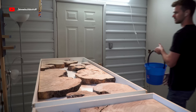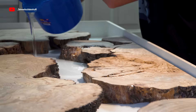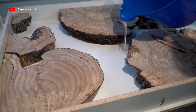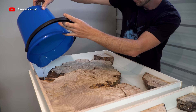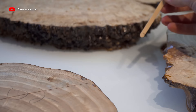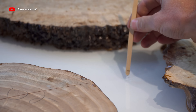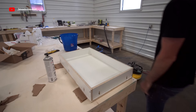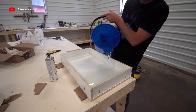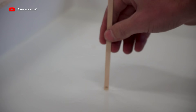This is the same epoxy I'm going to use for the whole table pour, but for now I'm just going to pour about a quarter inch on the bottom so that my lava stone and LED lights aren't poking out the bottom in the final product. Once I had roughly the right amount poured I used a stick with a quarter-inch line on it to gauge how deep the epoxy is all around the form. I also have this extra form I whipped up quick and poured in about a half inch of straight epoxy — you'll see why in a minute.